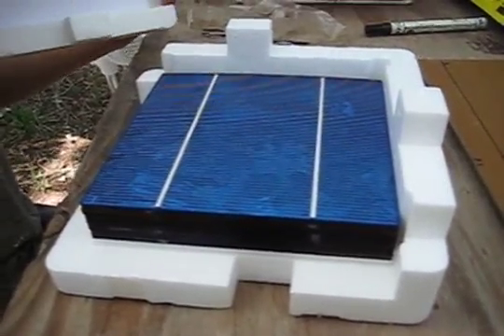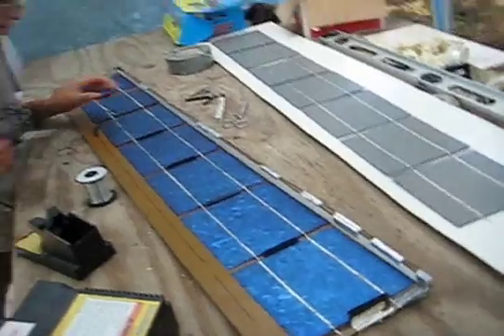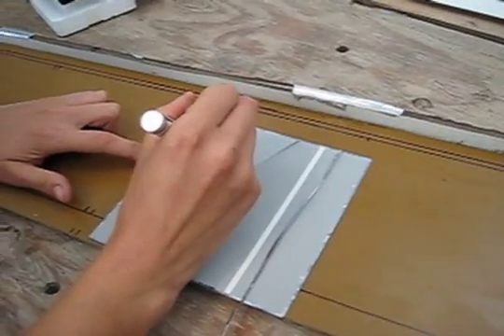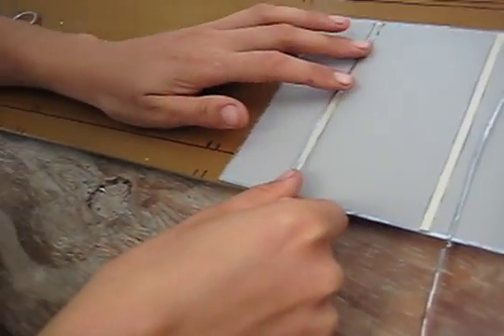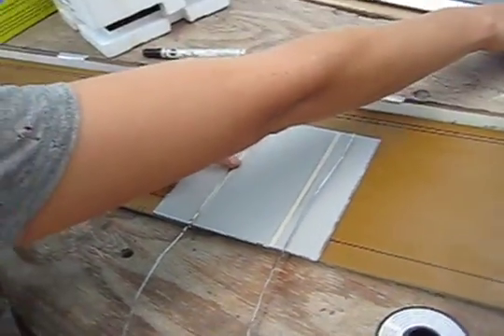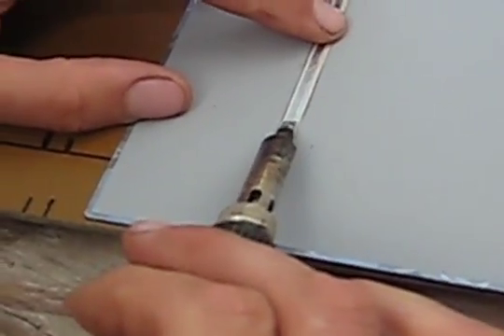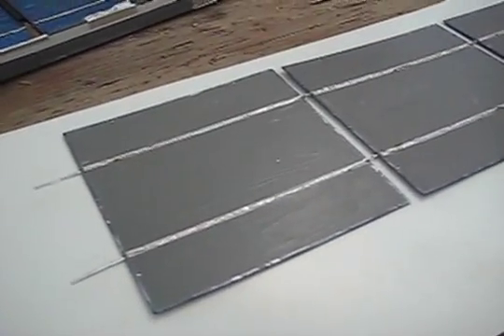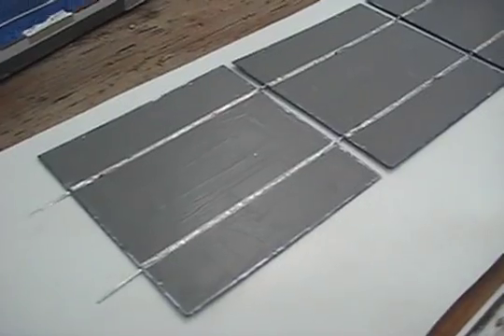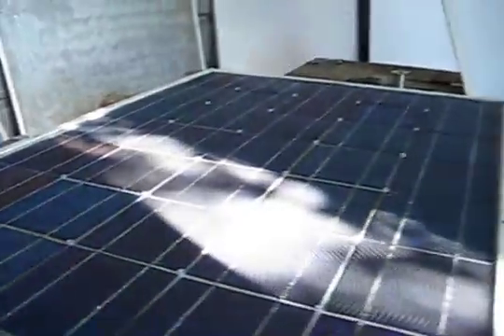A stack of a hundred solar cells. This is the process of stringing cells together on a form, connecting individual cells. Here we have a flux pen for cleaning the back surface contact of the solar cell. There's a little crimp there for flexibility so that the cells can expand and contract as they heat and cool. Here we have the backs of the cells painted with a 50-50 solution of GE Silicone 2 and xylene — for protecting the backs of the cells against corrosion. Here's a panel where we're putting on bus bars at the top, with all the strings laid out on one panel.